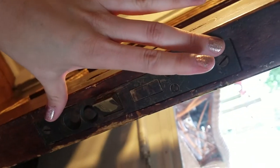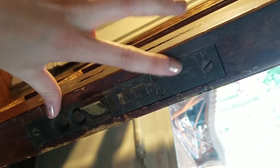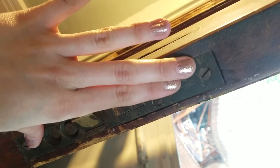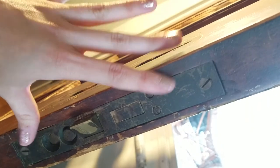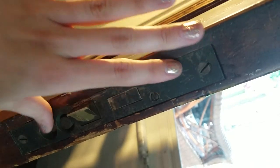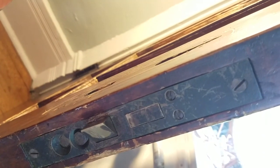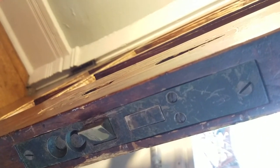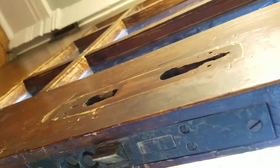You can take this full set out. I thought about doing that until I realized that a new mortise lock — which is this piece here, it's a little box that sits inside the door about three inches deep — was about $380 for a reproduction style. And that is just for the box, not for any of the hardware, not for the cylinder lock, no doorknobs, no plates, nothing. So keeping it if you can is really a cost effective way to go, and it's easier too. You don't have to drill any new holes in the door besides maybe a few new holes for your screws.